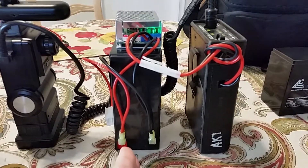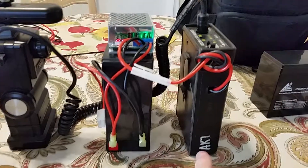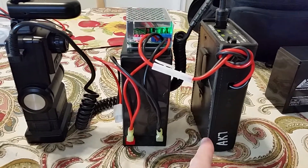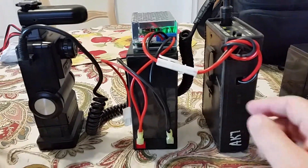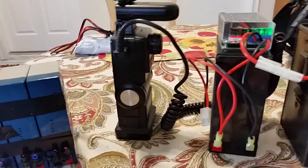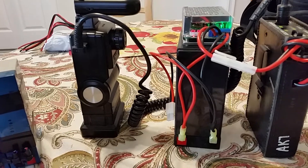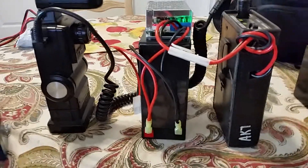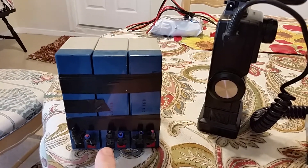The component detail: the 12-volt battery, which you can get easily. These power packs, depending on whether they're working or not — if it needs a new battery, maybe $40; if it works, maybe $80. What I've done is cut a hole in the side, removed the original battery, and now the wires just connect to the terminals, which are F2 terminals — or maybe F1. F1 is 3/16ths-inch wide spade; F2 is 1/4-inch, 0.250. It probably had the F1, which is 0.187 or 3/16ths.